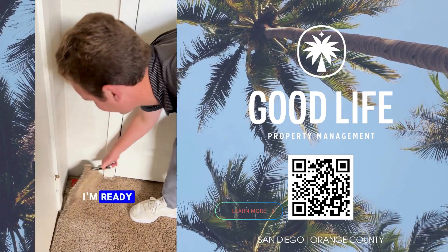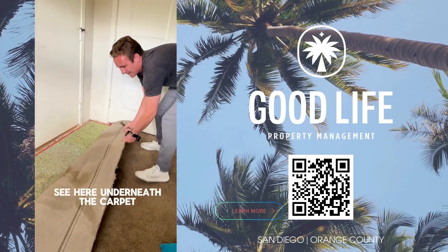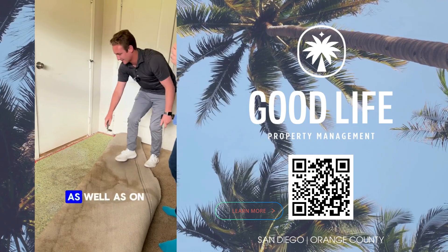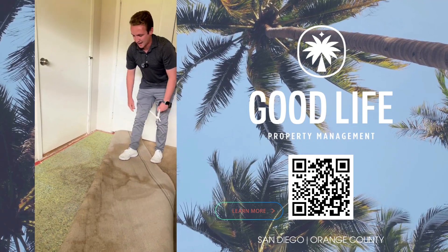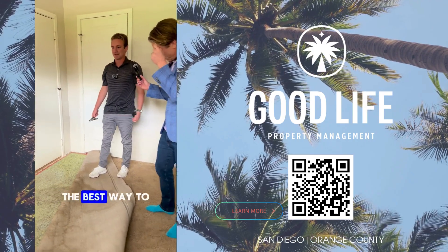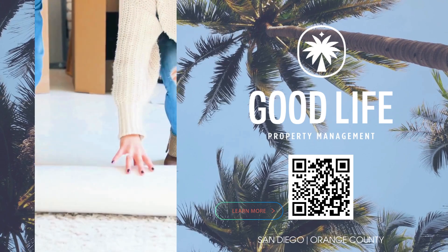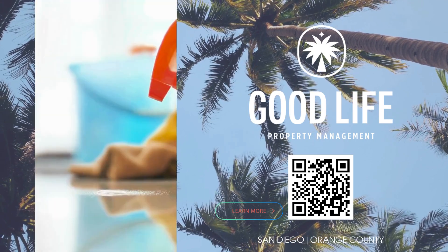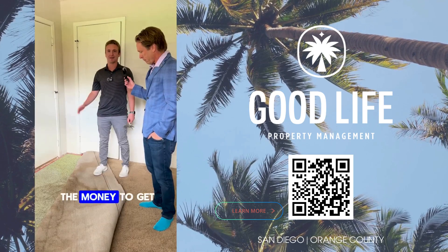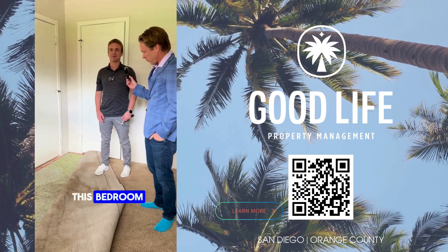Then you can pull up the carpet, and as you can see, down underneath you can see some staining on the carpet as well as on the pad. From what I'm seeing here, this looks like it could be a pet stain. The best way to get rid of a pet stain is to replace all the carpet and the pad, as well as do a pet enzyme treatment on the subfloor to get rid of the smell — so that if you're going to spend all the money on new carpet, you want to make sure it stays nice. That's what we're going to be doing in this bedroom.